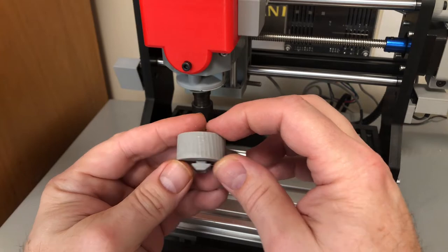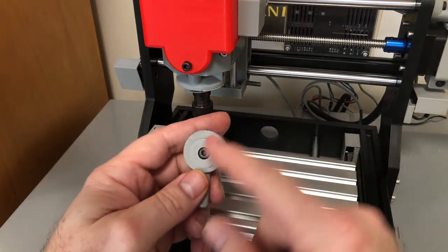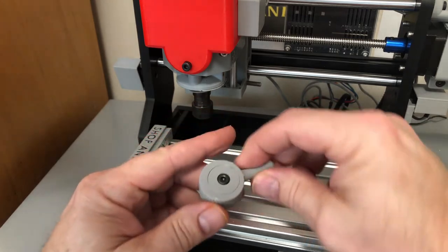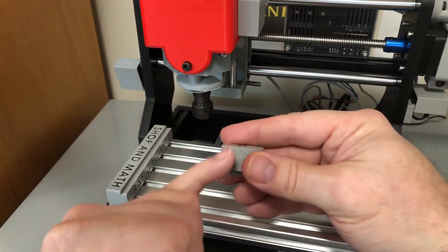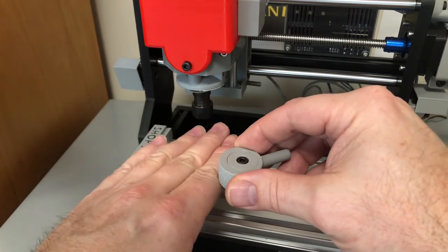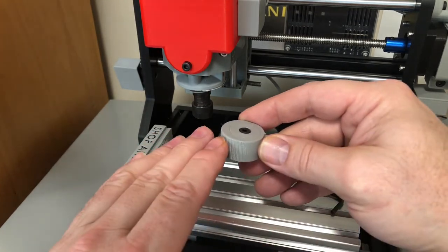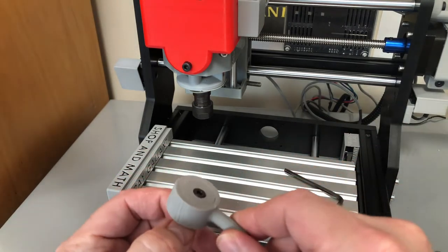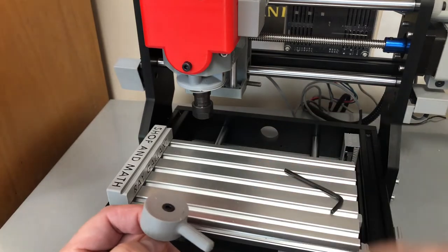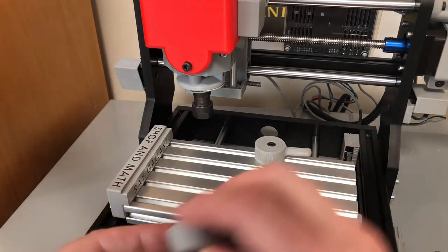If you take a look, there's a pattern on here, and you can see how the pattern is different from the right side to the left side. The cam activates from here to the center, so when I'm turning this way, my slices are going down this way. As I'm turning the cam and locking it into position, it's actually pushing my workpiece down. Same with the other side — when I'm locking the cam this way, it physically pushes the workpiece down. That's what's cool about the cams, though there are ones without that feature as well.